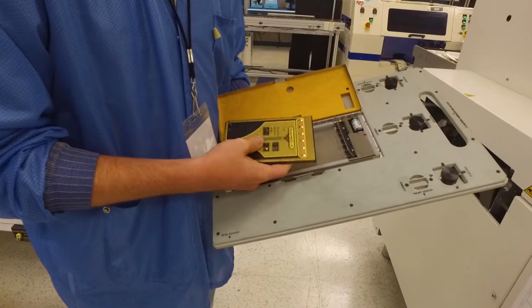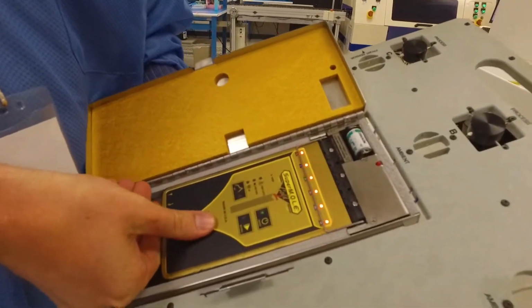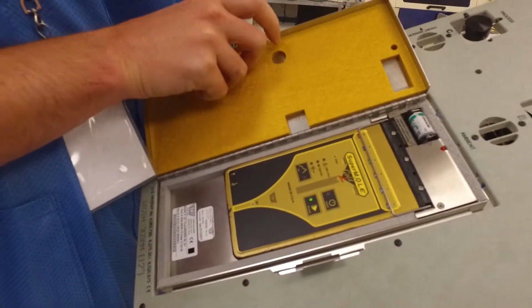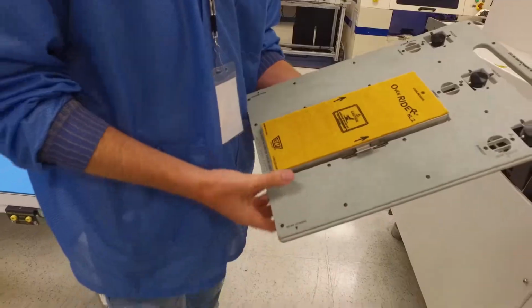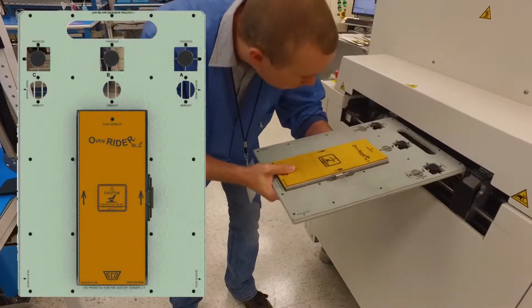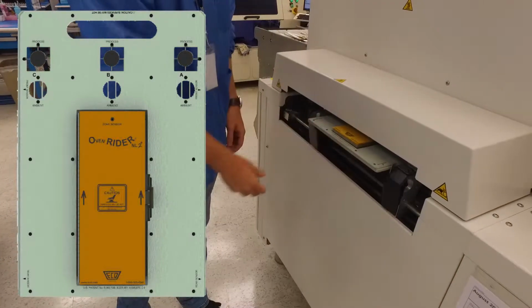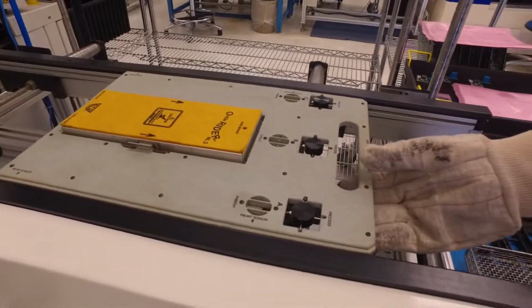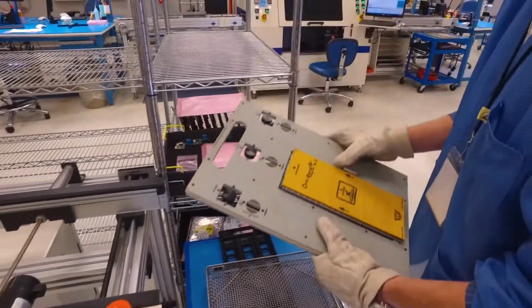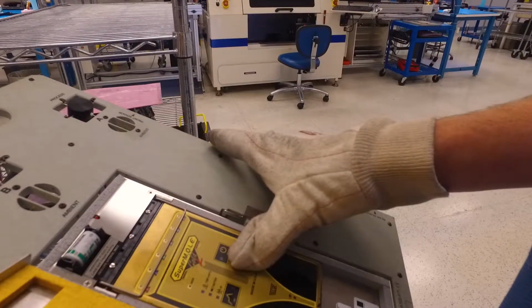The patented Oven Rider NL2 Plus travels through your oven with the Supermole Gold 2 inside, collecting data for analysis and SPC charting. A combination of ambient and process sensors measure oven performance, delivering repeatable data that can be used to identify modest trends which may be developing or serious conditions that have already arrived. Simple PCB profiling cannot detect all of the subtleties which can have a profound effect on PCB production quality.